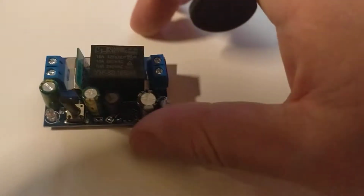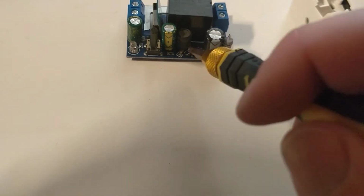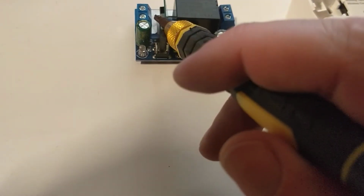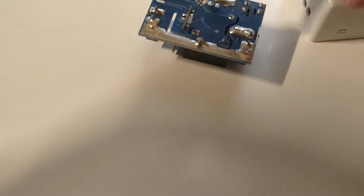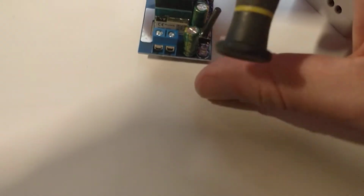I haven't looked at this chip here. I'm just gonna have a look at it now. See if I can see. Oh, of course it's got nothing to read on it. I don't think that chip is doing anything more than potentially being like an H-bridge type thing to drive the signal from the coil. I'll probably figure that out. Chips there. And it's here. What on earth is that doing? Could be part of the power supply too for this little board, which is doing all the thinking.